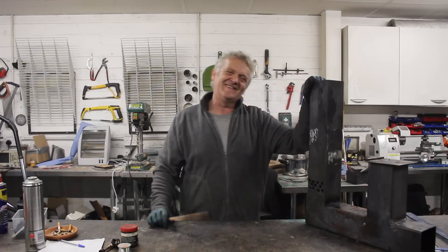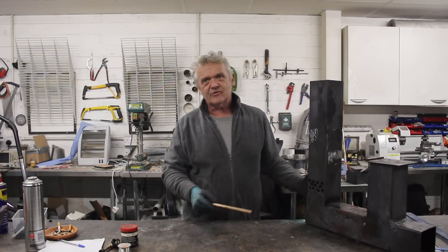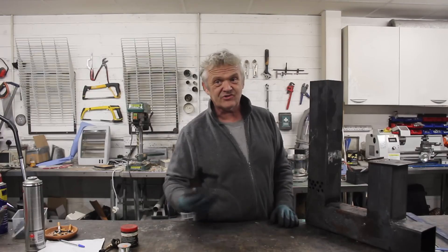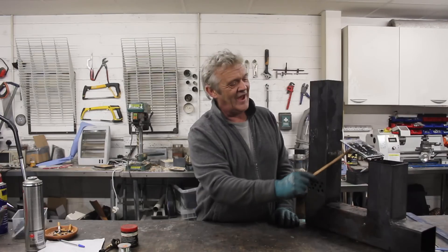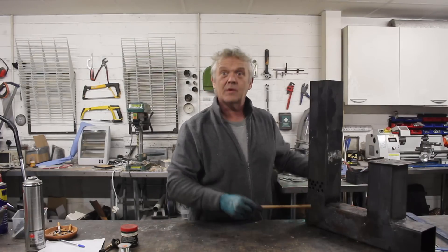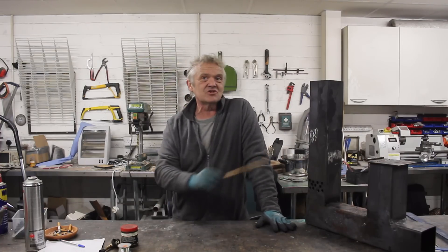This poor thing has been through a lot of abuse and many iterations, but this is the final design that I think is really awesome. I'm going to get the steel in for that final build — it'll look just like this, with a row of holes right there — because it answers a lot of questions people have been asking. For a hopper feed, fuel goes in there, put a hopper on there, clean right there. This goes up your ordinary chimney or attach a flue there as your air draw, so we get a complete burn. Stick some legs on it and we have a sturdy beast that will heat our home on solid fuel.